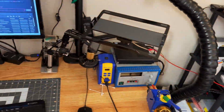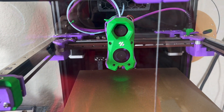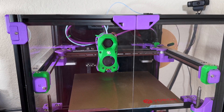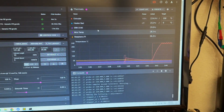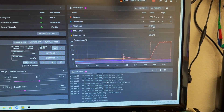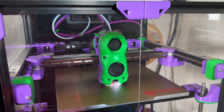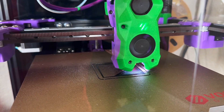Just connected the cable to the computer and now I'm running PID calibration. The main difference in terms of fans is that the SB2040 has separate fans that are always on or use a digital ground signal. With the SB2240, fans are connected and work with PWM control. In terms of how it works so far, it's very nice. One thing I noticed right away is the temperature of the board — only 29 degrees Celsius. We're going to print and see how it behaves, but that is impressive. I hope the main overheating problem of the SB2040 will be solved. Just finished calibration after installing the EBB SB2240, and now it's the first print.